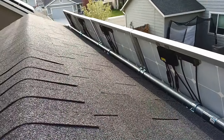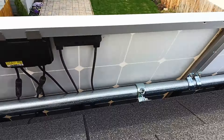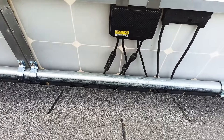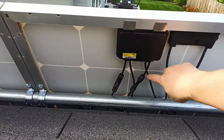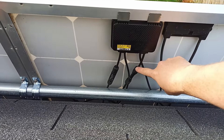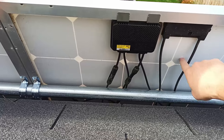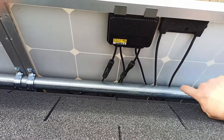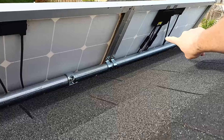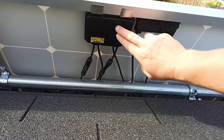In my case the first three are in series, and the last three here are in series, and then I paralleled them to up my amperage into my system. Then it's the long leads — you connect the panel to the short leads first, and then the long leads you treat just like regular wire. So when doing your connections it's long leads to long leads to the next one. But it's always the short leads to the panel first, otherwise you could ruin these.